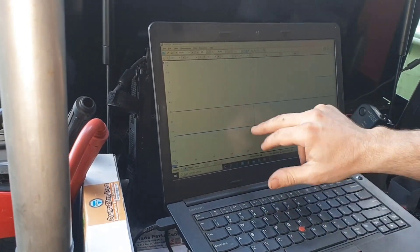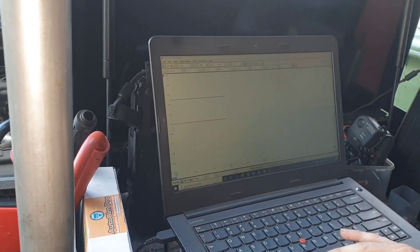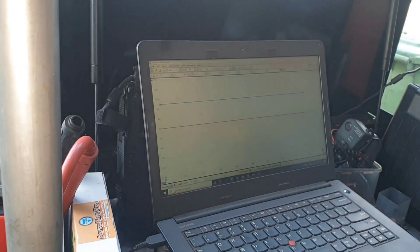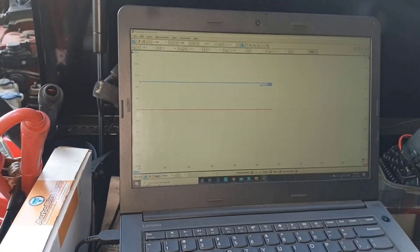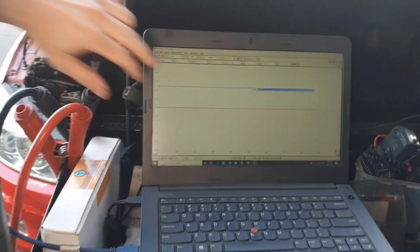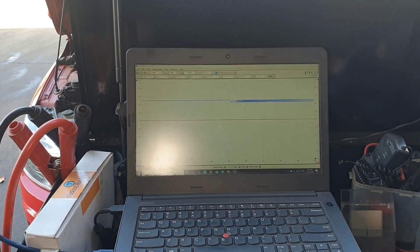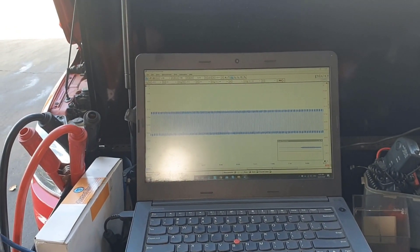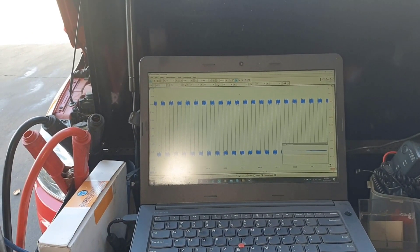We've got reverse polarity now — that's fine. We want to make sure we've got 10 volts; by the look of it there's 8 volts and 12 volts, so 10 right in the middle. I'm going to spin the wheel now so we should get some output from that sensor. You can see the output here, and if I wanted to I could zoom right in and interrogate whether the bearing has any failures — if we saw one spot that looked odd we could zoom in and say there's a problem in the magnet in the bearing. This one looks fine to me.